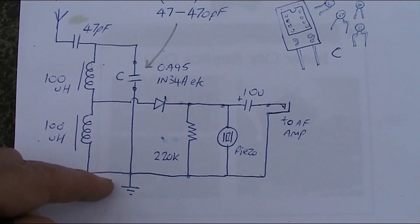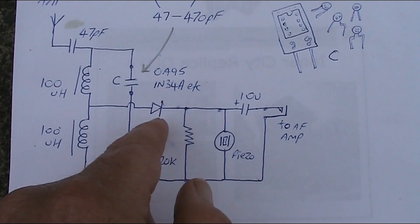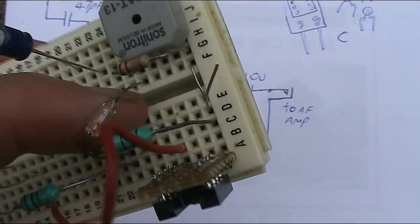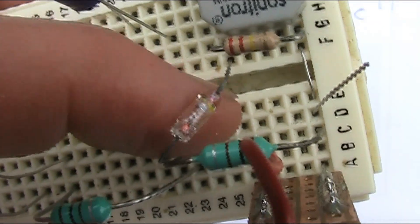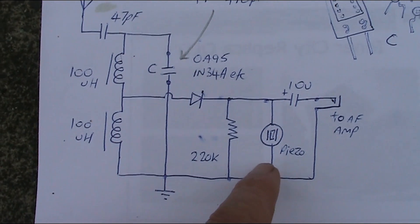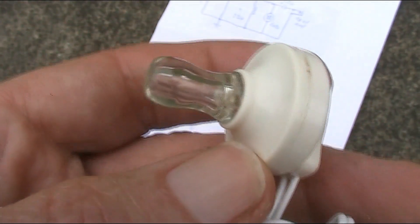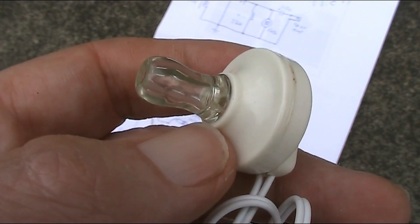I used a cold water tap or a stake in the ground. As for the diode, it has to be a germanium diode. Apparently there are fake diodes and they aren't so good. OA95, 1N34A — that's a germanium diode. Normally they are transparent glass with a band on one end. How that's connected in the circuit doesn't matter so much. What I'm doing here is you could use a crystal earpiece. These crystal earpieces are a bit bigger than the usual earbuds and they're just a single thing. The difference is they are high impedance and very sensitive — both things that you need for a crystal set.